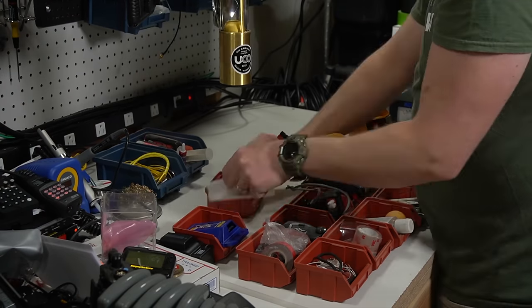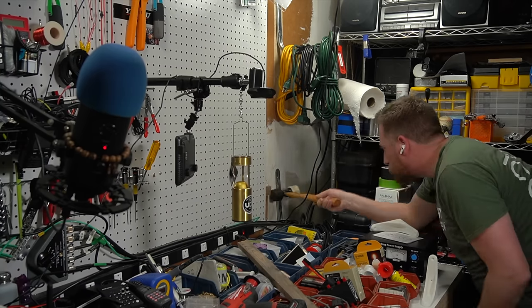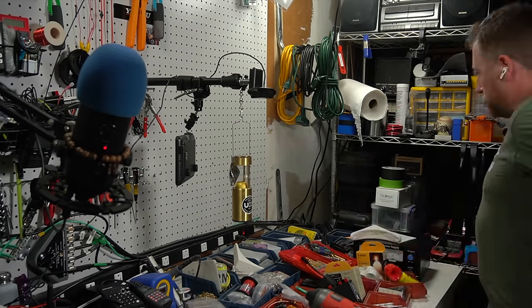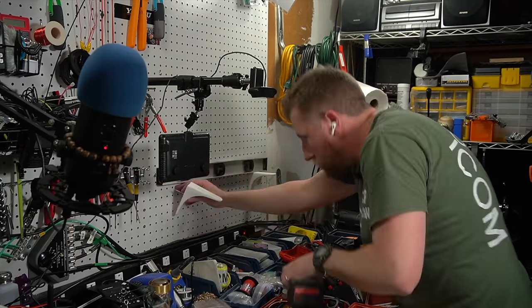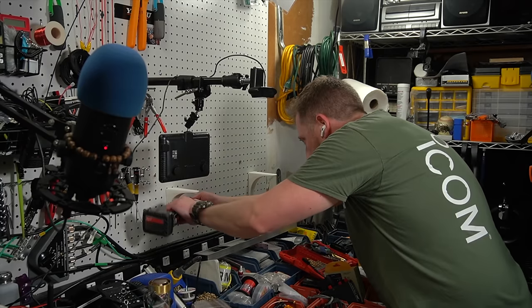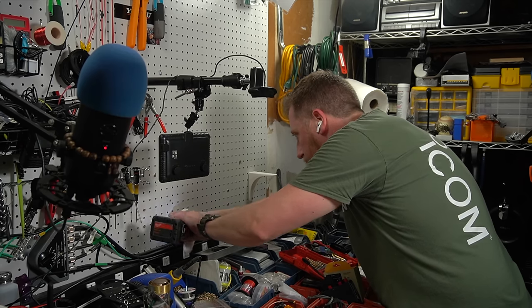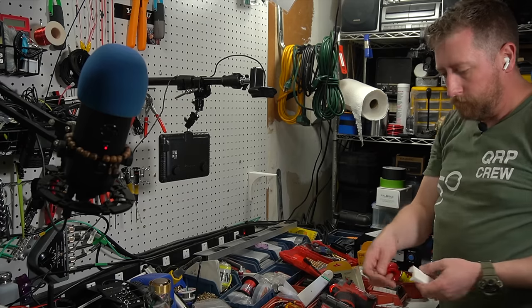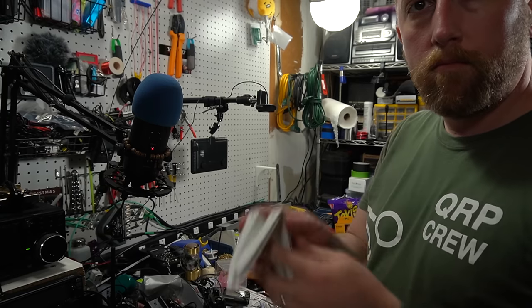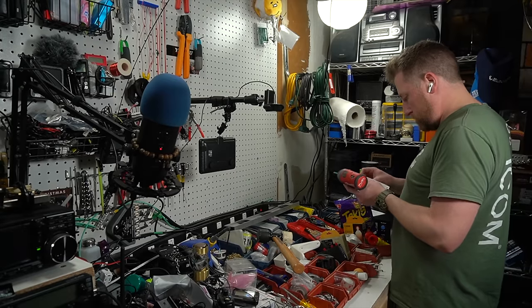So first step, pull the things off the wall. These little parts caddies are nice. Keep all my junk together. Furring strips go behind the pegboard to mount the shelf brackets. Real important for that. Into studs so you get a good firm mount. I'm using my 3D printed brackets here. And we have a problem. Yeah, these were not up to the task. No big deal, let's get some beefier metal brackets, get them set up.